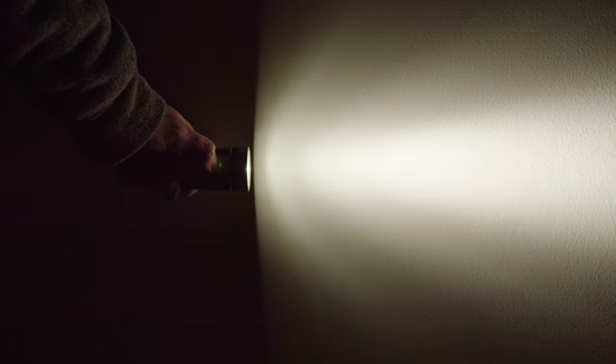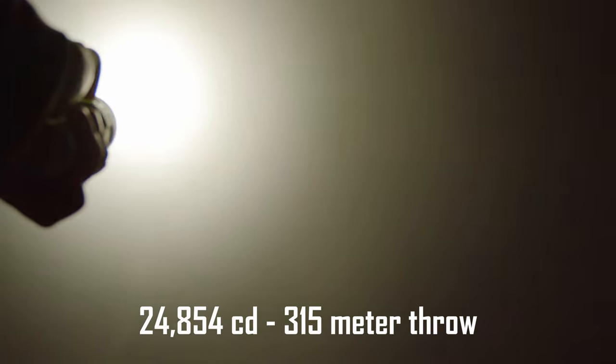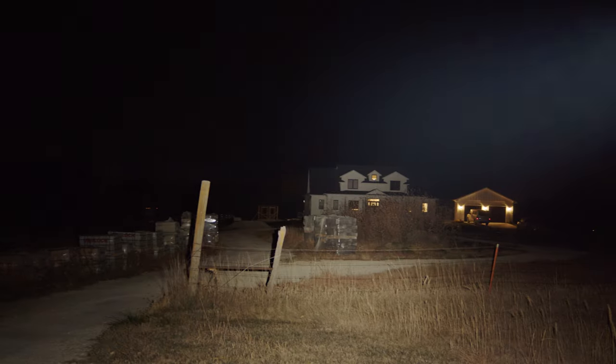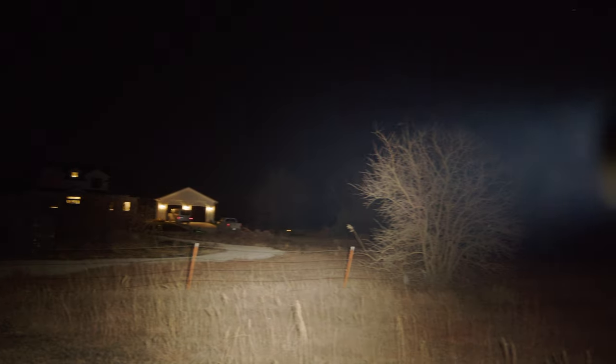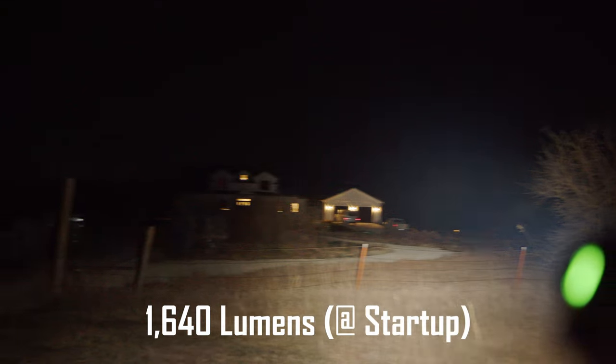This light here is actually pretty unique, and is not exactly the same as the one that is now available for purchase. This one has a B35AM at 5000K and a wide angle optic that provides a floodier beam pattern. It's actually different from the light being sold now, in which the optic has been modified to literally double the intensity. I measured an intensity of just under 25,000 candela in this light, which hardly makes it a thrower. However, this just so happens to align more with my own preferences, and I find this to be an extremely nice beam pattern that provides a fairly wide hotspot with a strong spill that gradually fades outward. It still has plenty of throw for my uses, and is impressively bright at over 1600 lumens at startup, which shows this emitter is being driven right in its sweet spot for performance.